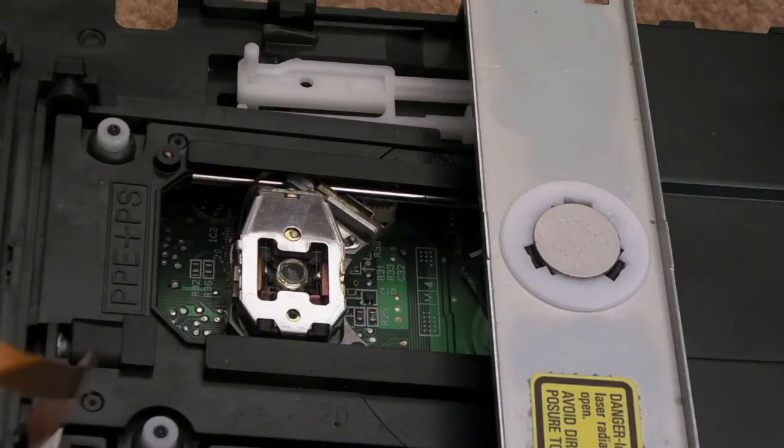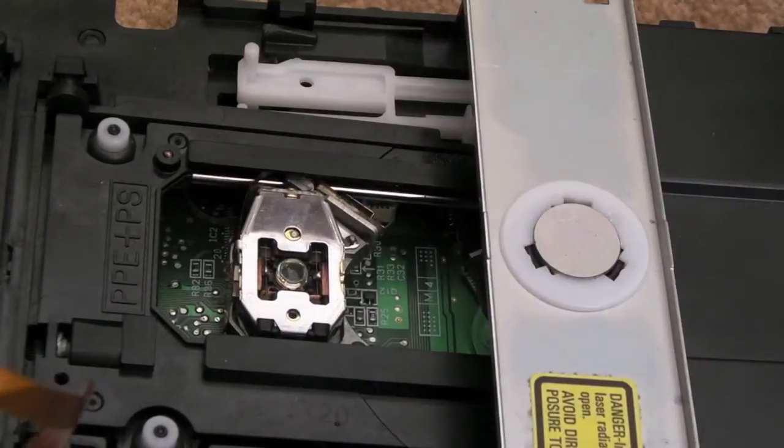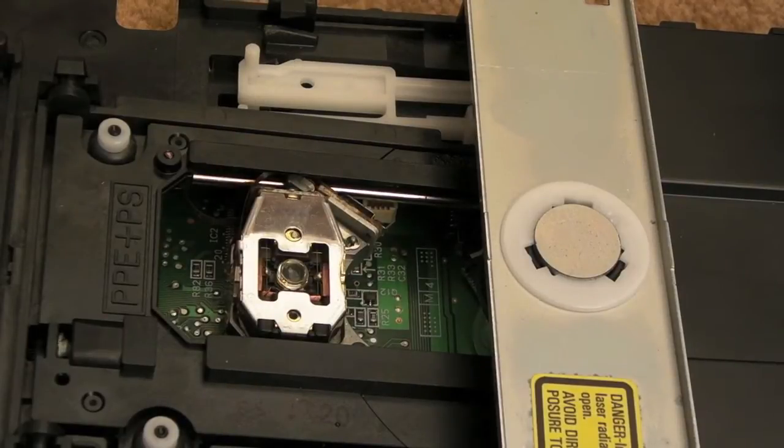The couple of CD systems I've looked at recently have not been pleasant at all — they're horrendous things to work on. It's not so bad if you're an expert at CD and laser technology. If you've got the right kit, you could put some sort of probe or sensor over the laser and look at your scope or meter and see if there's a laser signal — determine the milliwatt level or whatever lasers are rated in — and know whether it's focusing correctly.